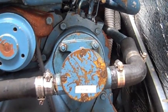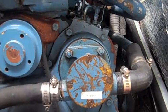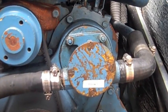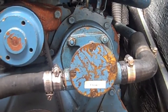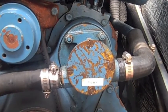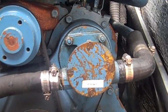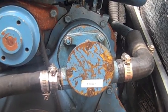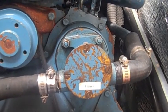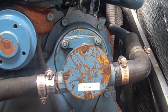The cover's back on the impeller housing. The impeller is coated in a silicone O-ring grease and the cover's on tight. I put the cover on tight rather than leave it off, because if she were put in the water in the spring and this cover were off, she would fill with water if the seacock happened to be open. It's better to run the risk of forgetting to put the impeller back in than to have your boat launched and have her sink to the bottom. We have a checklist, so in the spring we go through everything and check and double check to make sure it's where it ought to be — so we won't forget to put the raw water impeller back in.